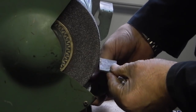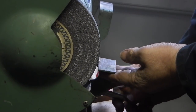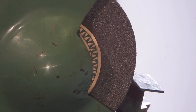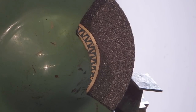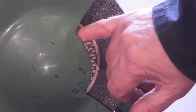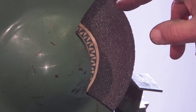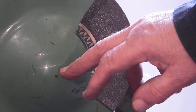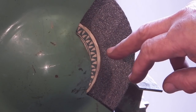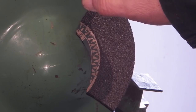When you've dressed the surface of the wheel all the way around, you need to check your rest and make sure it's close to the wheel but not touching. That's truing the wheel up — it's not balancing the wheel. I've not seen a bench grinder that you can balance the wheel on, because to balance a wheel you usually have small weights on a special flange that you can adjust around the diameter to move the weight to different areas, and you also need a balancing spindle and usually knife edges to balance it on. Please do not try to true the wheel up by putting shims under the flanges — this is dangerous because it shifts the clamping force to a smaller area of the wheel and could result in the wheel cracking.